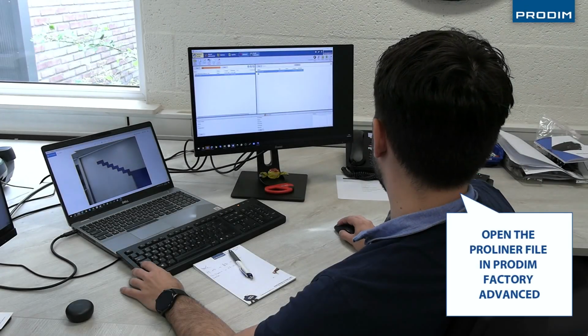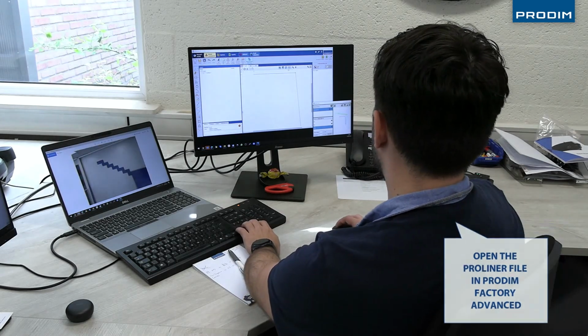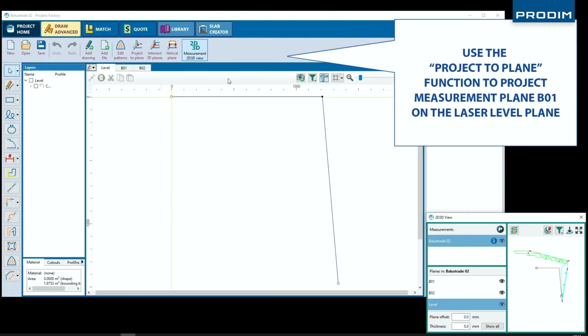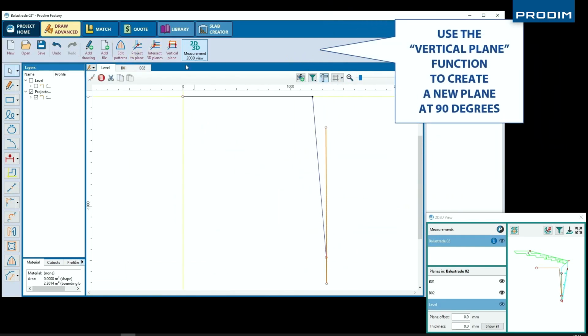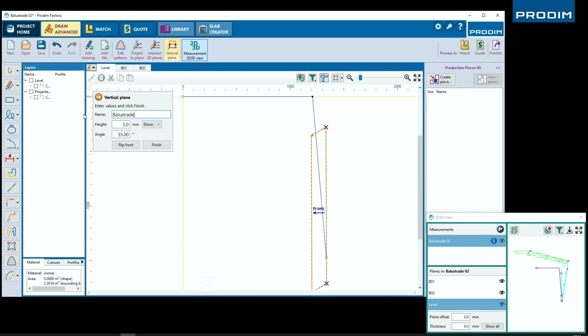Take a look here at this next video, which will show the editing process from the measurement we've just taken. Our first step is bringing that file into the Prodim Factory, which here we have now opened up in the Draw software. The Draw software utilizes a lot of the tools similar to the Proliner, but it has a lot more advanced features as well. Here you will see creating vertical planes off of the level surface that was first measured in the measuring video.